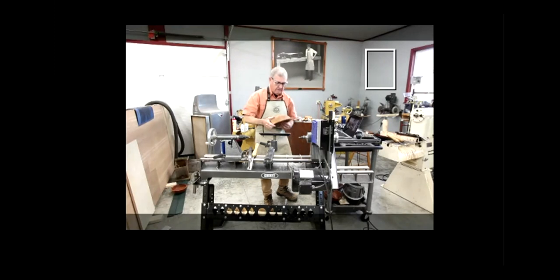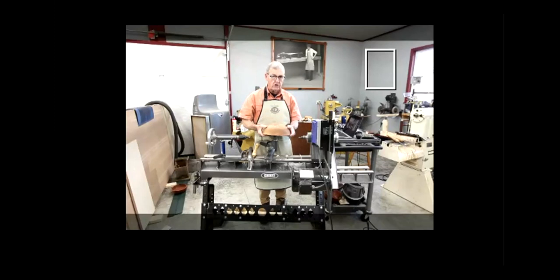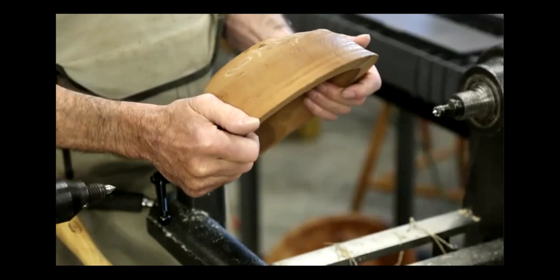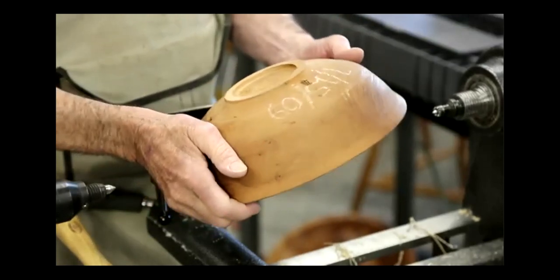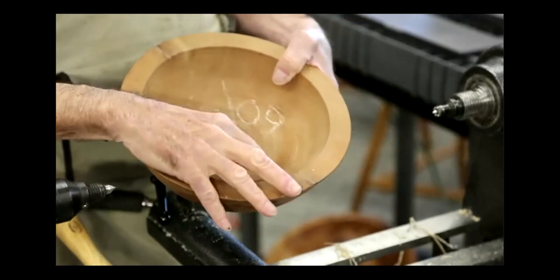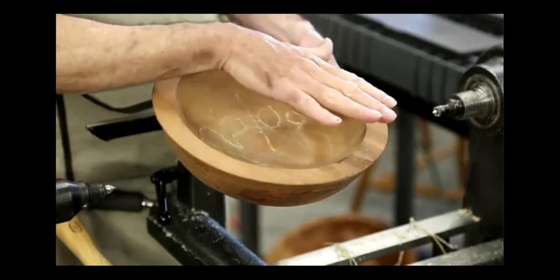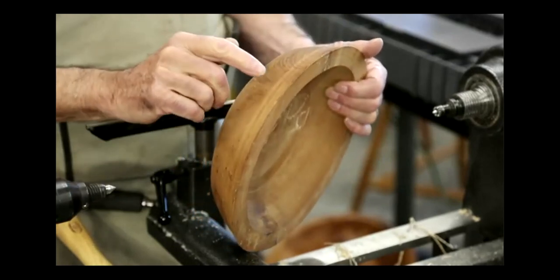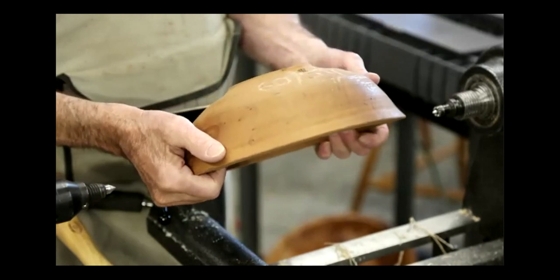And that is another thing in bowl turning that I'll mention, which is repair on the fly. As you go, we all pretty much turn green wood to start with. This is a bowl that I turned in '09, blanked out. As I watched it start to dry, I could see that there was going to be a pretty good defect here. I'm pretty close to the center of the tree here. And so I hit all of these little spots with water thin super glue.